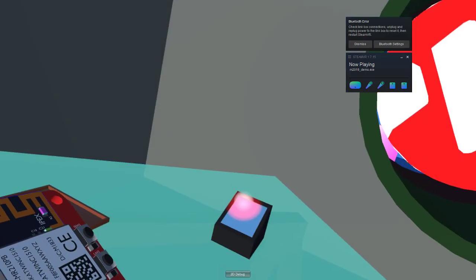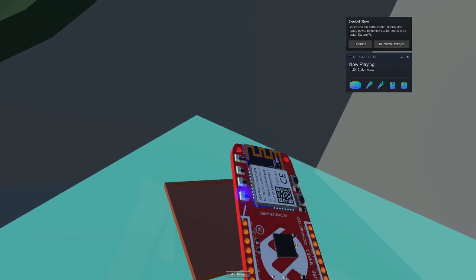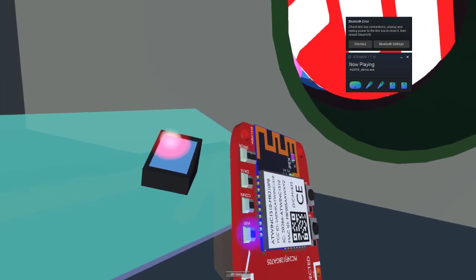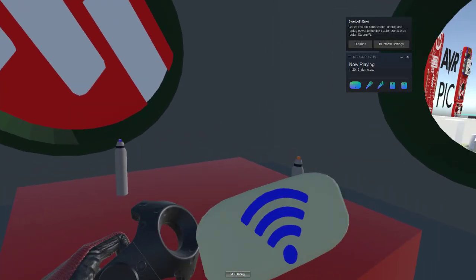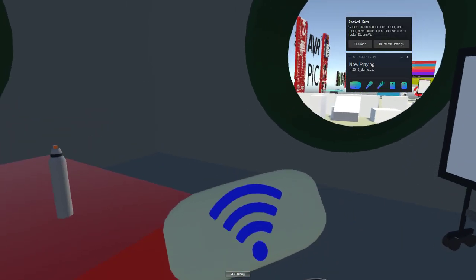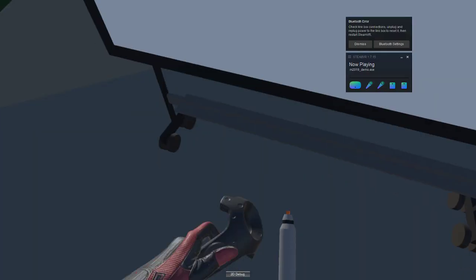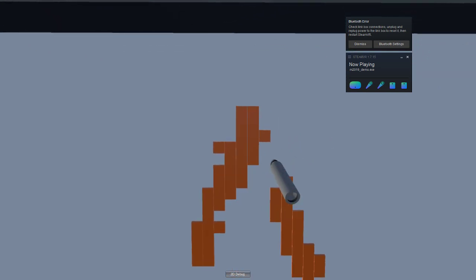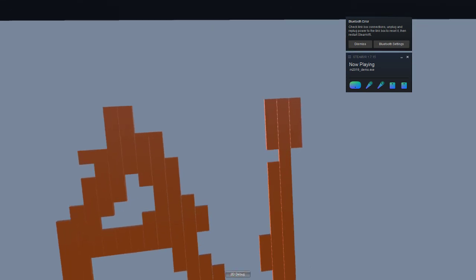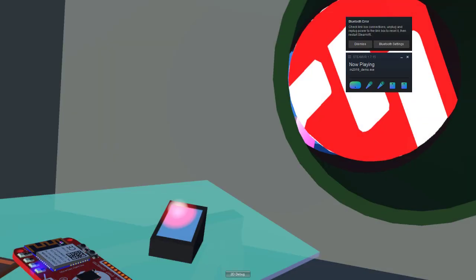So the updated firmware version is going to say, if I don't have the red LED, then I'm going to end up seeing a blue blinking LED. That blue blinking LED means that I'm trying to get some type of Wi-Fi connection, right? So I need to load the SSID, the password, whatever it may be, to gain access to my access point. I'm just trying to get to my local AP. It's all local. I can do a soft AP, whatever it may be.